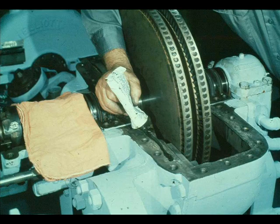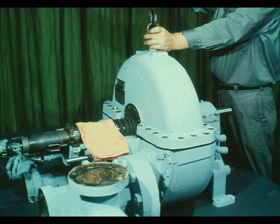Now that the carbon ring packing has been replaced, we can reinstall the cover on the turbine case. First, however, the workman applies sealant to the joint between the case and cover. Check with your instructor to find out the type of sealing compound in use at your plant. He will also demonstrate the proper methods for applying it. Once the sealant is in place, a shackle is fastened to the eye bolt in the turbine case cover, and the cover is lowered to a position just above the lower half of the case.